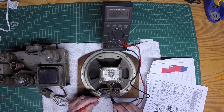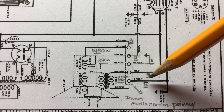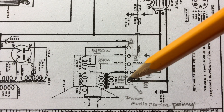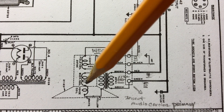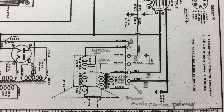I did trace these connection points back to the number 42 output tube, as well as one of the electrolytic capacitors in the center tap of the high voltage transformer. Now referencing the schematic — I inserted the audio generator between points number four and five, which is the primary of the output transformer. I read around 663 ohms of DC resistance. By inserting that audio carrier at that point, I was able to test through the secondary, the bucking coil, as well as the voice coil, and confirmed that I could hear audio.